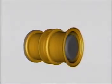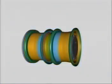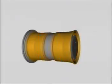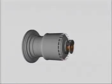We now strip away tyres and view the rear assembly. The flanges have been coloured green and the bead seat bands have been coloured blue. The lock rings have been coloured red and the rim bases are coloured yellow. We now remove the rear wheel motor cover and all 12 retaining cleats. When all these components are removed, we are left with the rear hub assembly. The disc brakes can be seen at the extremity of the hub. We can now observe the hub rotating.